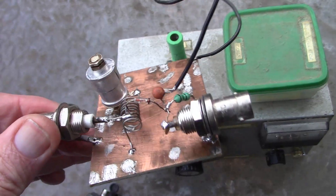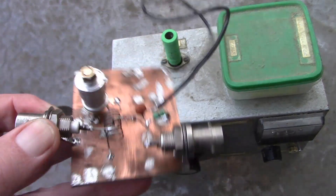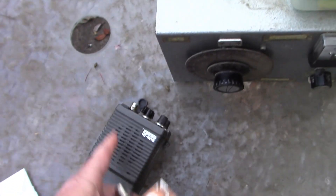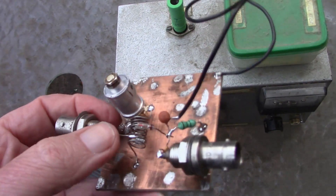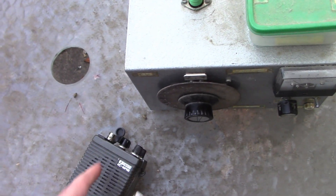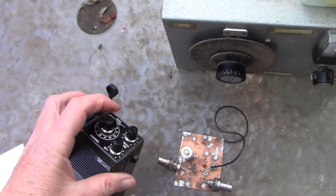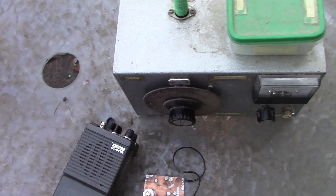As you will hear in a moment, there are a few shortcuts. It doesn't have an RF preamp, it doesn't have a lot of front-end selectivity. There will be cases where you hear harmonics of this oscillator in the receiver at 157 MHz. So you will find dead spots when you tune around — the squelch or mute kicks in. You just tune off to the side, and if that coincides with a desired signal, luckily with this you have different channels, so you can just move to another channel, readjust slightly, and you should be okay.